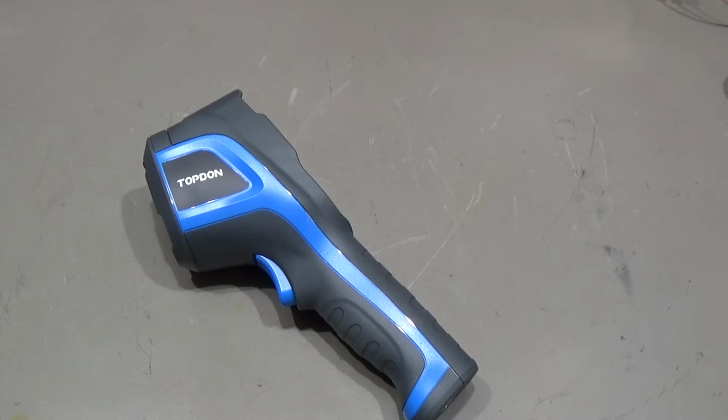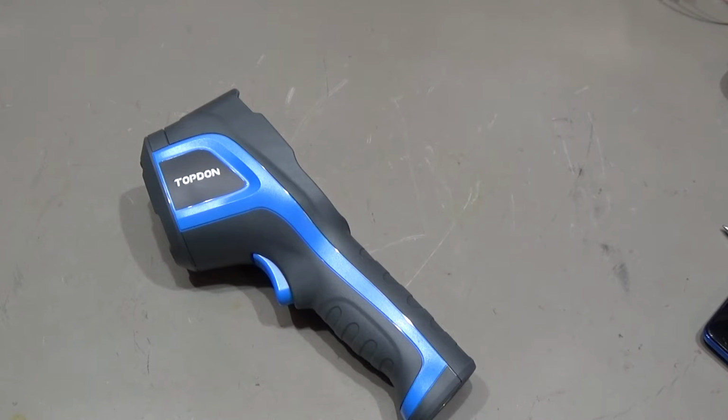And what I really don't understand is that you very seldom hear something about the NETD, which is the noise equivalent temperature difference. In other words, that is the thermal sensitivity. I only hear people talking about the IR sensor resolution. Sensor resolution is important, and we have seen it before when we discussed it. But without a good NETD value, it is still a problem and you do not get good thermal images.